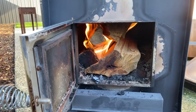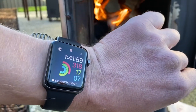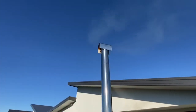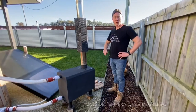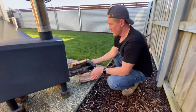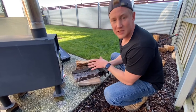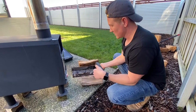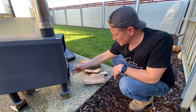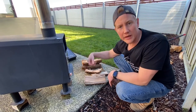The fire is going — we started it up and the time is 1:40 PM. A couple of things to mention: when you fire it up, just make sure that your ash tray is relatively empty. Get the ash out — having it empty will maintain the airflow. Also when the door is inserted, don't insert it all the way; have about a 20mm gap that will allow for easy breathing and sufficient air for burning.